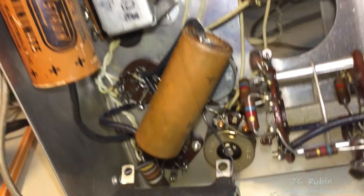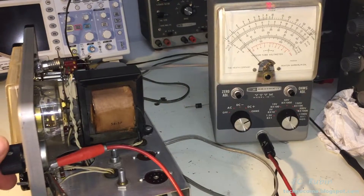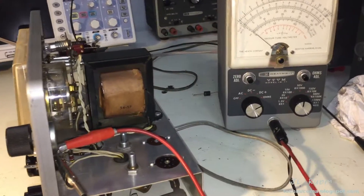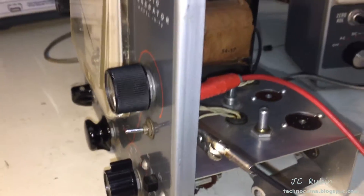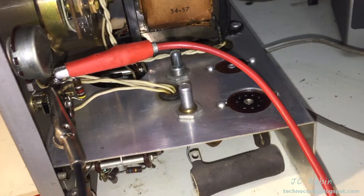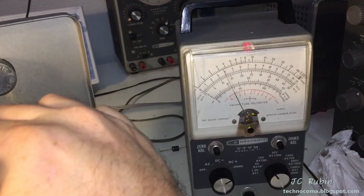There's only one potentiometer on the top side for regular use; there are two down here just for calibration, but equally important — they'll need to be cleaned with DeoxIT and measured. On this one, as I do sweeps, it comes up halfway and goes back down — not reaching full potential. I've seen this before and it generally tells me the pot is good but there's an electrical connection issue. The only way to confirm is to tear it up, which I'm not going to do. If it functions fine in circuit, I'll leave it alone. The 600-ohm pot on the bottom, however, sweeps nicely up to about 550 and back to zero — that one's good.